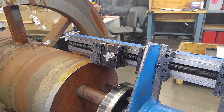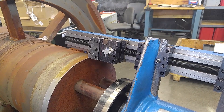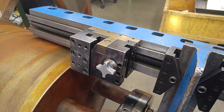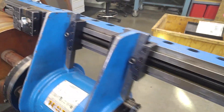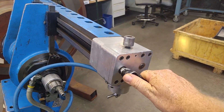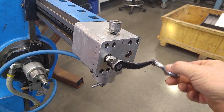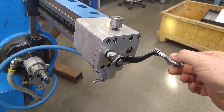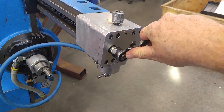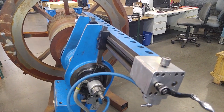Something else to check every time is the amount of backlash or the condition of the lead nut on the tool head. The best way to do that is to lock down one of the Gibbs screws and then come to the back of the feed arm and just try and move the hand crank a little bit. This has got very little movement — maybe an eighth of a rotation or so, and that's actually okay. If you get to the point where you've got half or a third rotation, that's an indicator that the brass nut is wearing out and needs to be replaced.